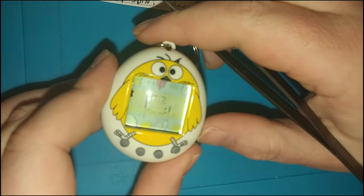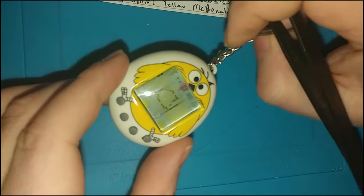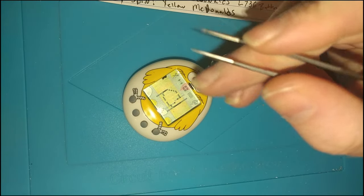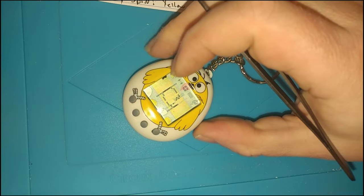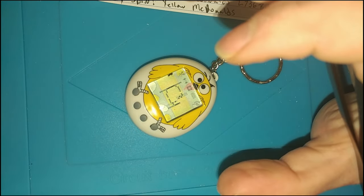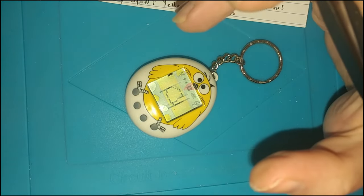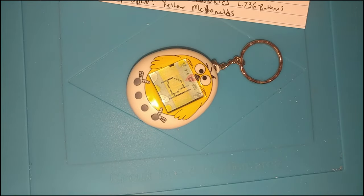However, this was a cheapo knockoff made from China. I think we successfully demonstrated that you can move bleed out of the way to recuperate some screen space. So overall, I think this was a good, possible attempt at repairing a damaged LCD, which means that eventually when we get to the one that had the bigger bleed on it, we could potentially repair it.